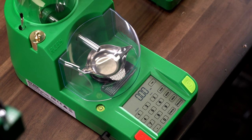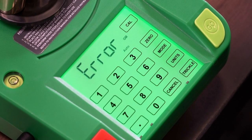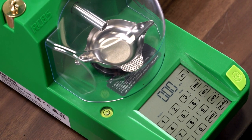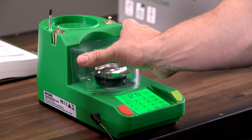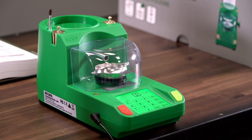If you're operating the unit outdoors or in an area where a draft is present and your measurements are getting errors, the cover is necessary. But make sure that you calibrate the unit with the cover on, otherwise different measurement readings will result. Different values with the cover are caused by static charge buildup on the cover. When the scale is not in use, be sure to keep the cover on as it will protect the platen and load cell.